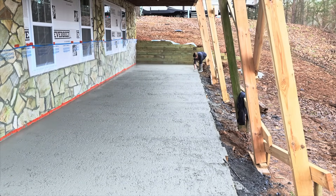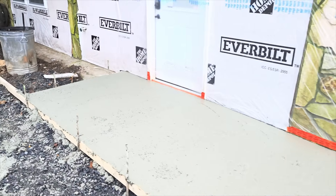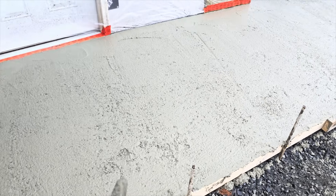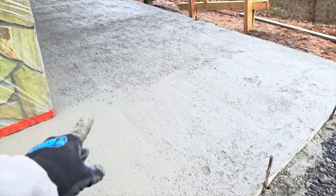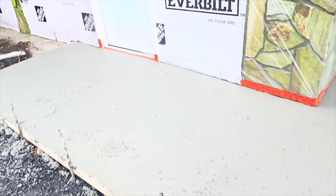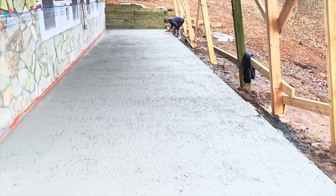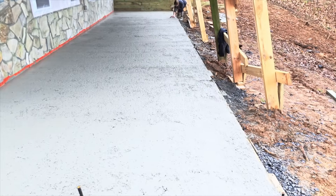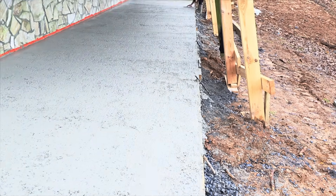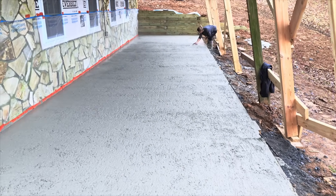We started about 7:55 and it's now 8:35 — so 35 to 40 minutes to get it poured and screeded. It's colder, probably warmed up to 34. We screeded with a 10-foot board all the way down, then turned with one man on a five-foot and worked our way out. It's tightening up pretty quick — we'll bull float it, cut some joints, and do a nice broom finish. We may cut a border eight inches to a foot wide so those posts have some expansion relief.